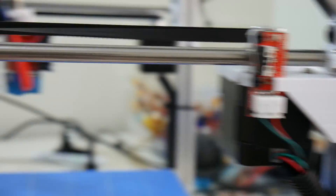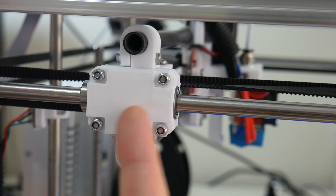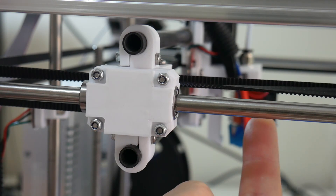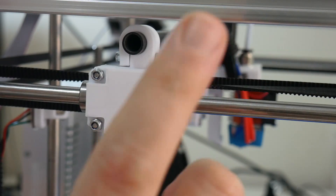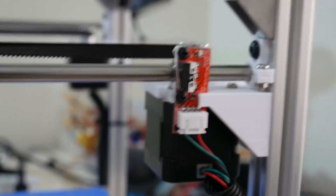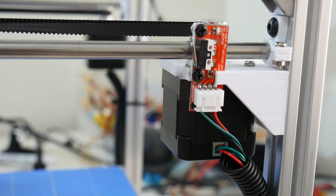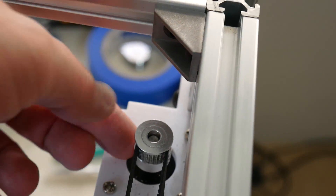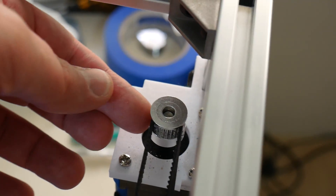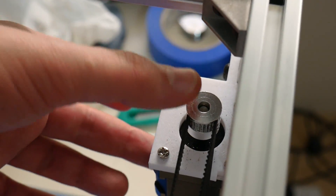However, using feet plus AstroSyn dampeners on each X-Y motor doesn't stop the bearings in the XY joiners from rattling, because vibrations are still being transmitted through the belts, which are directly attached to the XY joiners, which clamp around the bearing rattling on the wire rail. That doesn't mean we shouldn't use them. The only issue with the left-hand X-Y motor is that the pulley is already mounted quite high above the stepper motor shaft, so you'll need to raise it another 5mm to offset the extra 5mm height that the AstroSyn dampeners add to the entire motor assembly length.